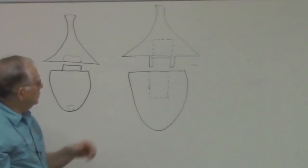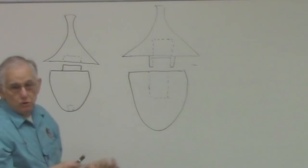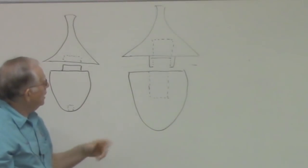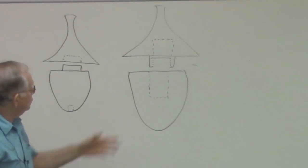And the advantage to that is the weight's reduced slightly, but it gives me the capability of reverse chucking it to finish off the other end. And then if you need to touch it up, you can always put it back and reverse chuck it again. You don't destroy any of the chucking.